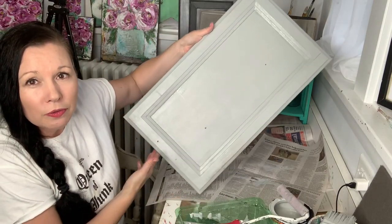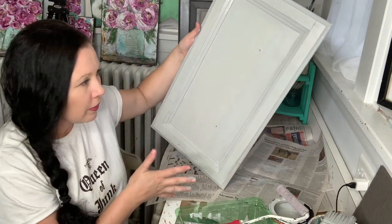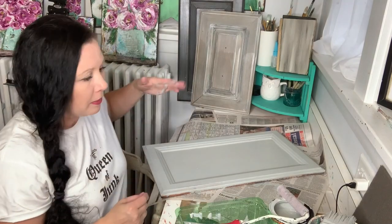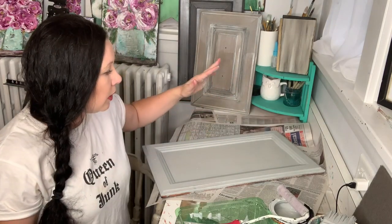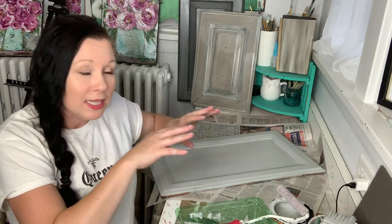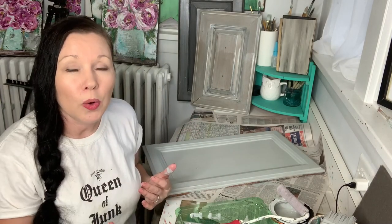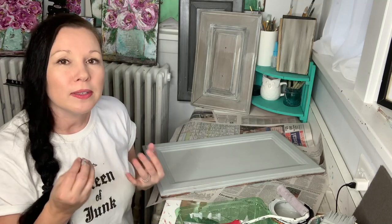We have now transformed this door from that rustic glazed antique look to our very first coat down of Mouse in the House. Now we've got to let this dry. I know you're going to want to speed it up — can I use a heat gun? You can, but do you really want to force anything? Let the paint do naturally what it wants to do, which is dry and cure. Paint will dry from the outside in, putting roots in and being sucked into those wood pores. When your paint job is dry to the touch, you can begin your second coat, then your third coat. Remember: two to three light coats — three coats really strengthens your paint up nicely.